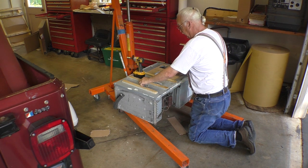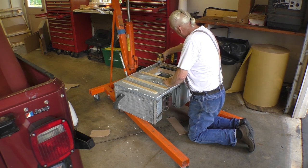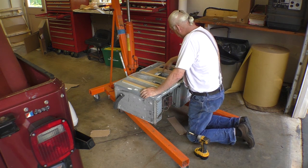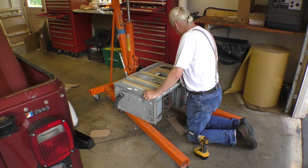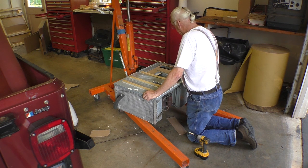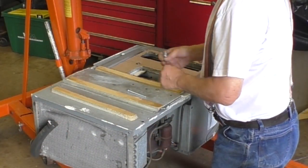and these bolts go into the old holes. So that locates the template such that I should be able to take this template and go up on the roof and find these exact same bolt holes. So the plan is these openings are not the same in the old air conditioner and new air conditioner. They're in the same locations but different shapes. So I should be able to locate this squarely on the bottom of the air conditioner that's on the roof, and then locate the holes that I need to drill for the new air conditioner, then drill those holes in the roof and have them so that the air conditioner will sit square and the holes will be in the right location.